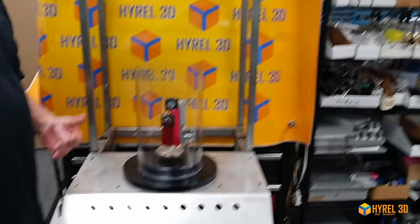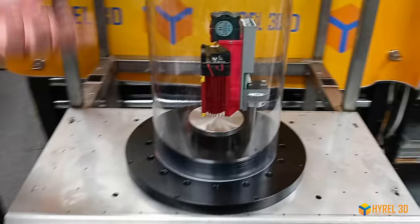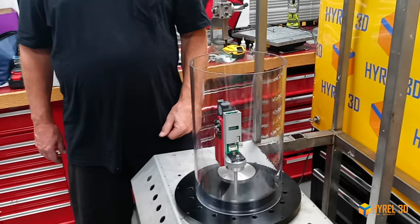We have one model that allows you to reach very high chamber temperatures — I tested it to 300°C. The materials, when you buy the stainless steel version, are compatible to over 450 degrees centigrade. So if you want to do direct printing of glass material, for instance, or do research on that — we're not selling that process, but we're helping people develop it for themselves — this would be an ideal solution. Okay, that's it. Happy holidays and look forward to showing you this functioning and printing with it over the next month.